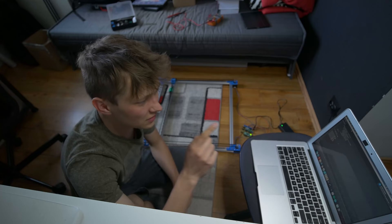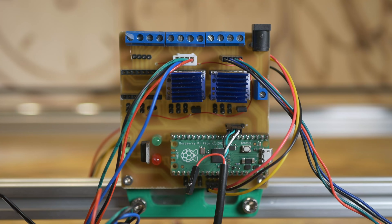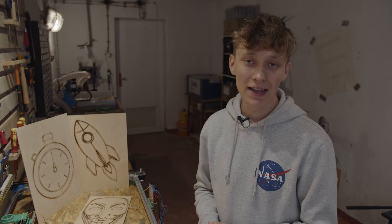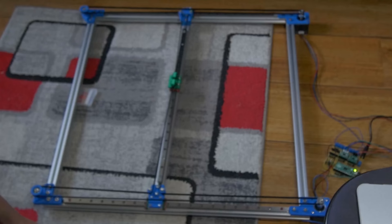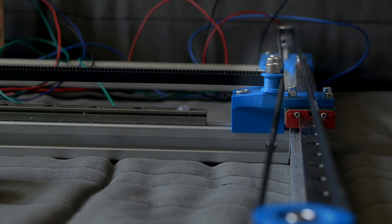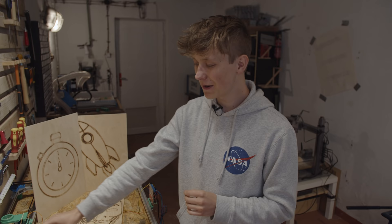I changed the pin numbers in the code so now it should work as it worked before but with the PCB. The PCB turned out actually quite decently — it wasn't really that easy to solder because there is no solder mask, so usually this kind of PCB made at home is not great for soldering. But you can really quickly get a prototype of your PCB, which is great. There is still a problem: instead of the pulleys and bearings I used just a 3D printed part attached to a screw and that was a terrible idea — there was a lot of friction and everything was bending.